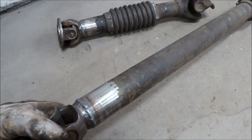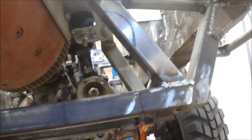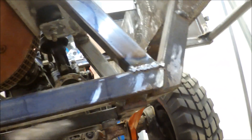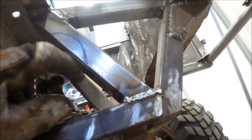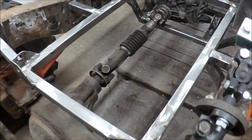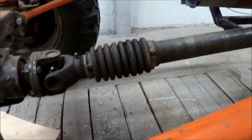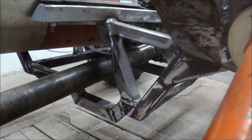The RPMs shouldn't be that off-center to cause any problem — it's not a high-speed vehicle. You can see here that the rear axle can move 100 millimeters up and 100 millimeters down, and the cardan axle hits these two supports. I think I'll cut this one and put a tube underneath, and maybe make a triangle there, then fill it with two-millimeter plate — I think that would be enough. Here you can see the front cardan axle in position and the angles aren't too bad. Here you can see the rear cardan axle and the angles there are even better than the front. I had to massage the frame so the rear axle has free travel space.